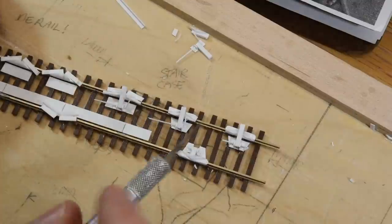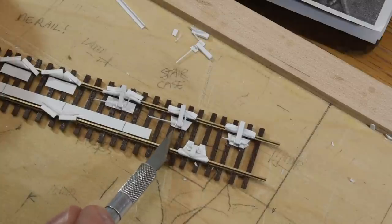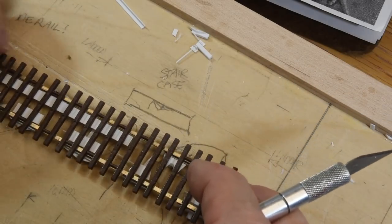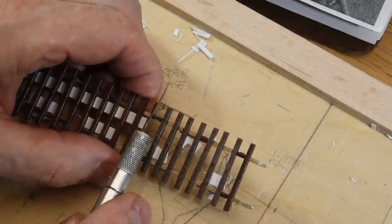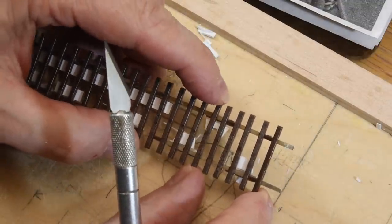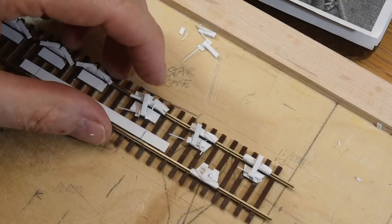Okay, so here's one more tip. When you're laying up your derail device parts on the rail, like you tack it to the rail here, and then you decide, oh geez, the tie's in the way. When you want to center this and create some space so this bar can hinge back unimpeded when you go to operate it on the jig, well, just turn it over and remove these little spacers. I just cut them out of there. All you need to do is push down like that, carefully, and then move that out of there, and then you can slide that tie over. So see here? I can move that tie, because this track essentially is a jig, right? See the tie plate moving underneath? I can line it up, and just create a bit of space for the bar to fit in between when you roll it back to test it, okay?